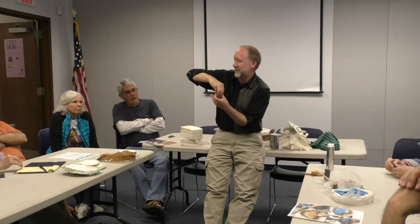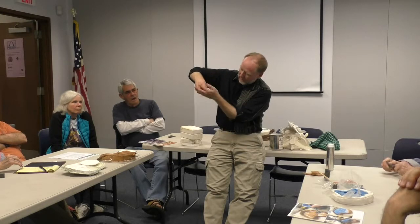These are very solid. You can't manipulate them. The way ceramics work, you make the clay really, who's done some slip molds before ceramic work? Okay, you get the clay really wet and goopy, pour it in these holes, slosh it around so it coats the whole inside, and the plaster is gonna suck some of that moisture right out of the clay and harden it up. And then if you're real gentle, you can open it up and you've got a hollow lemon that you can put in the kiln and fire.